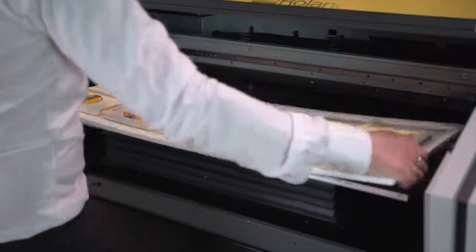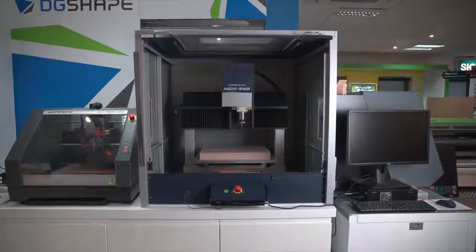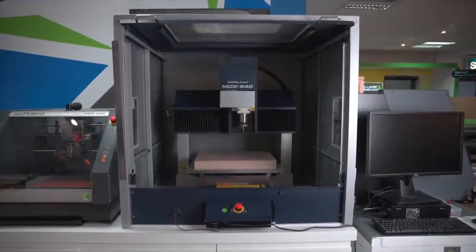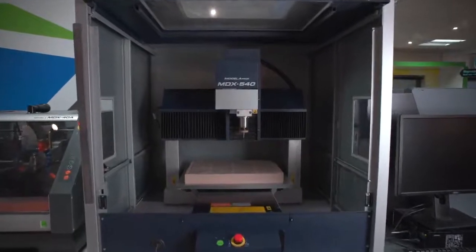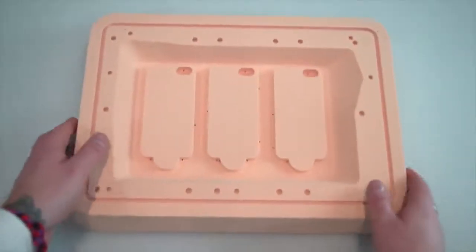When printing, the surface of the print area should be as flat as possible to minimize overspray. If you make two of the same jig, you can load one with blanks whilst the other one is printing. If you want a more accurate option than hand cutting, or if you have complex shapes or very thick material, you could follow the previous steps for template creation but then cut the jig using a laser engraver or a milling machine.